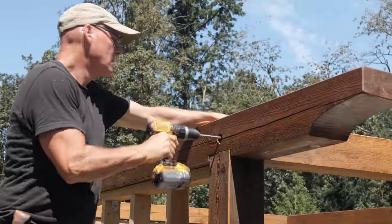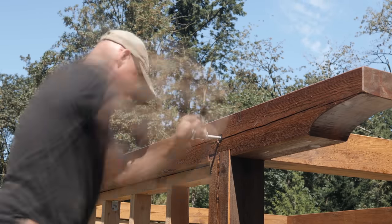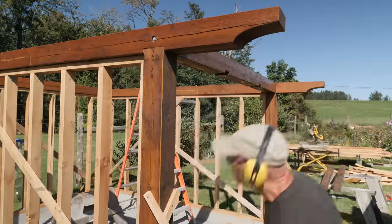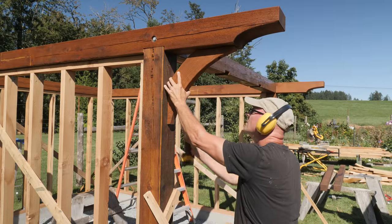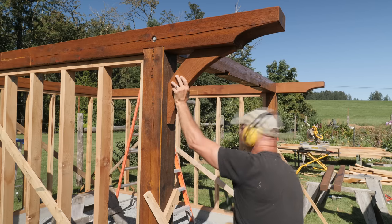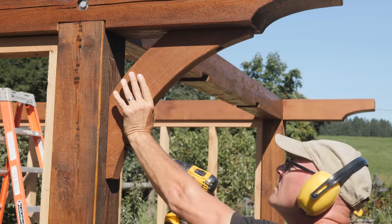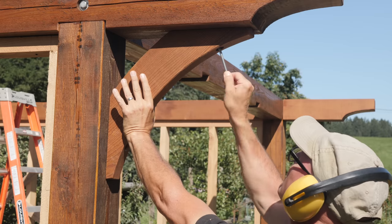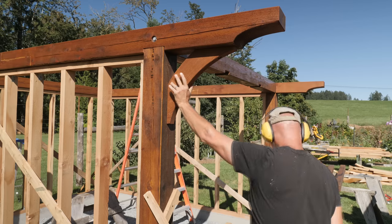To tie the beams together, I'll drill and run in horizontal lag bolts. I have four corner braces ready to attach to the post and north-south beams. These are flush mounted, drilled, and held in place with lag bolts angled in toward the post and beam joint. I've added these same curved braces to other structures I've built and covered them in other videos, so I won't go into that detail here. I'll put a link to that video in the upper right and in the description below.